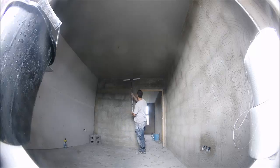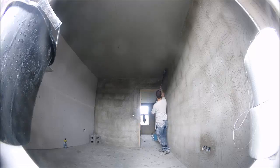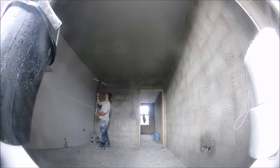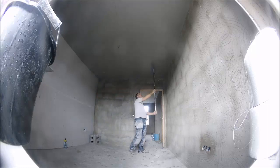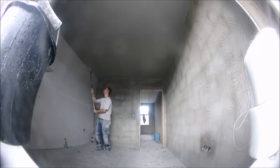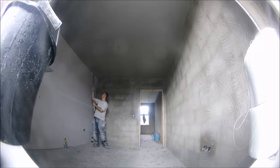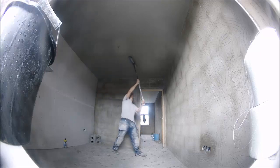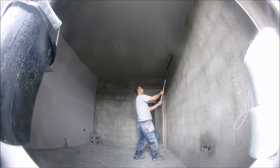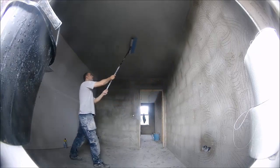This next stage is optional — most people will have a hop-on trowel if they're going to attempt to plaster. I'm using the speed skim here to straighten the angles and flatten out any lines, and I find it gives me a wee bit of a break off the stilts. As soon as I have the ceiling coated I drop off the stilts, give the speed skim a wet and give it a quick flattening — it doesn't take too long to get around the whole ceiling and I find it helps the next trowel. But you don't have to use the speed skim; you can do this stage with just a hand trowel.